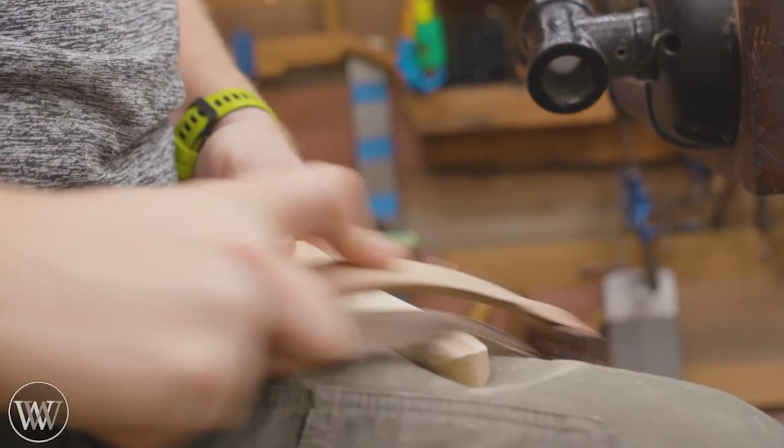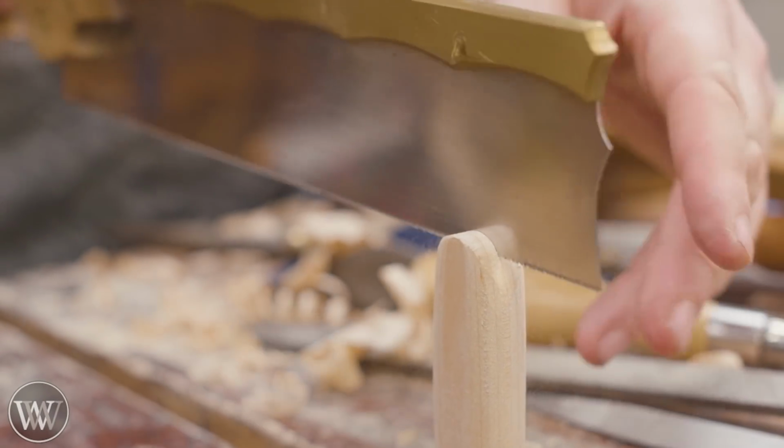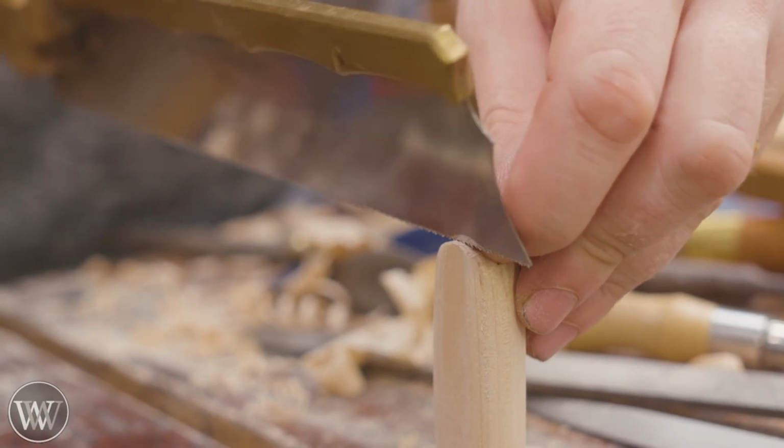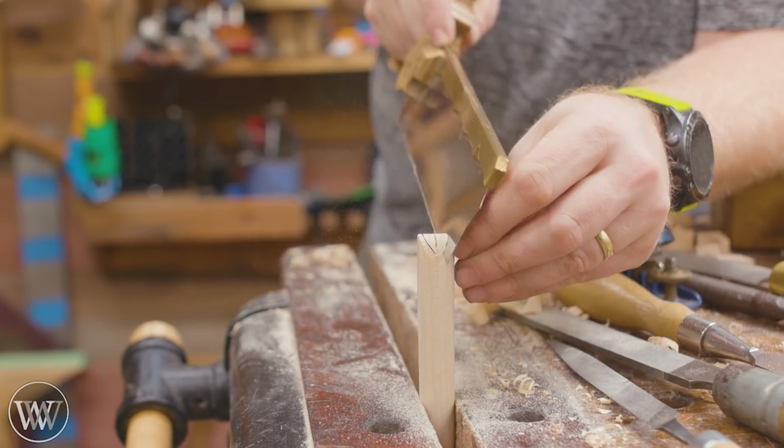This is a bow sander, which I often use for that final detail. Sanding allows the finish to soak in a little bit farther. It actually will draw it and wick it down into the surface because all the pores are full of dust. That'll actually draw it in a little bit farther.